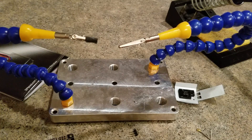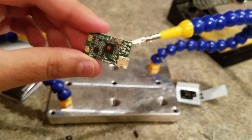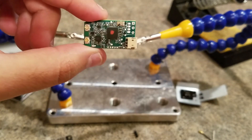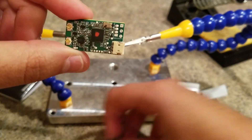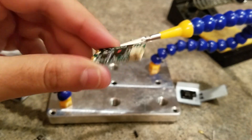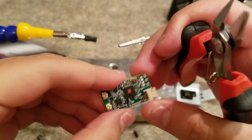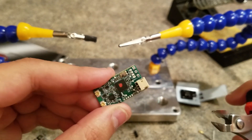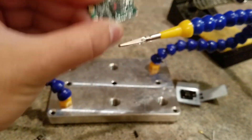While the soldering iron is cooling, I forgot about this connector here — this is your voltage sensing connector. Now assuming you're using our flight controller, it will already support serial telemetry, so you won't need to use this port to detect voltage or anything, since the flight controller will take that and send the data to the receiver. So for this connector, we don't have to be as careful removing it. Since we're not planning on using those pads anymore, we can go ahead and not worry about destroying them.